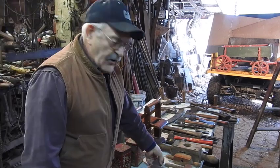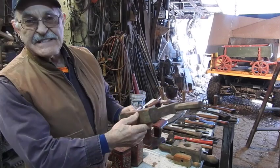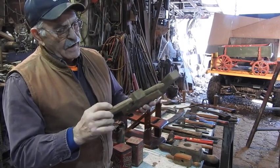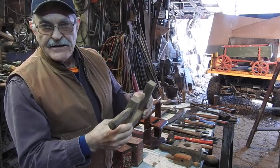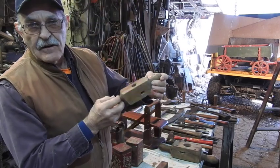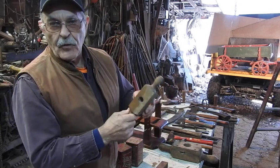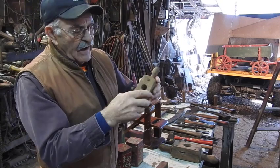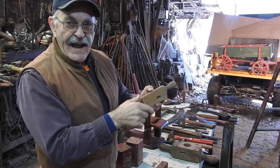The very next thing he's got sitting here is an old — I don't know if it's handmade, blacksmith shop made, or whatever — but it's a C-clamp made entirely of wood, with wooden threads and the whole bit. If you're familiar with how the old-time guys made those threads, you can see right here — this is your thread die. You would make your dowel pin, use a draw knife to make it reasonably round, and then slowly cut the threads. There's a knife that inserts right down into the crack, and you just make sure the knife is sharp and slowly cut the threads down the length.